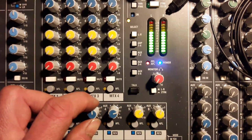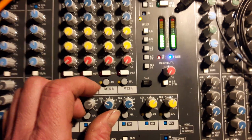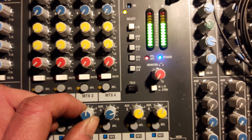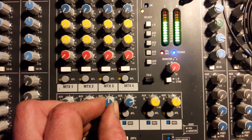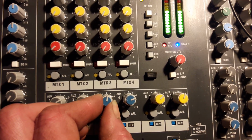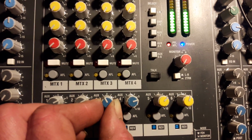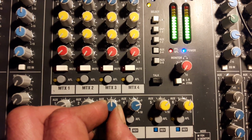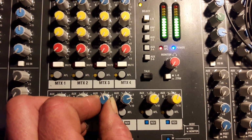And if I want to go down 10 decibels from 0, to the second white tick mark, that's 10 decibels down. And it's good to know what the dB difference is for these little white tick marks. Let's go back one white tick mark. How many dBs does it remove? Right there you can see it's taken off 3 dB from here to here. And it might be even a little bit more than that.